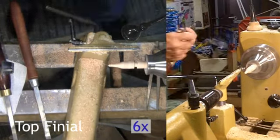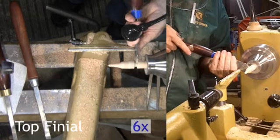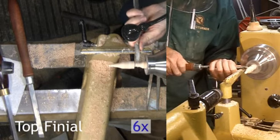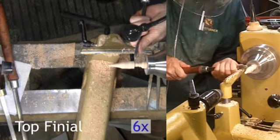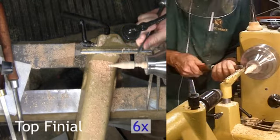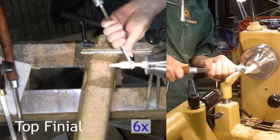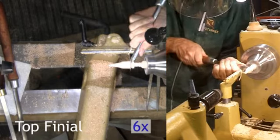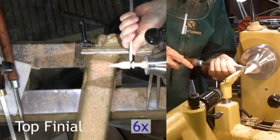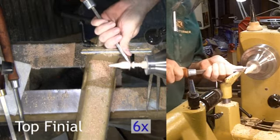My fingers get hot very quickly and for safety I don't want to wear a glove. But for the final cuts, I have no choice but to stabilize the wood with a couple of fingers from my left hand while holding the skew with the remaining fingers in my right hand. Fortunately, I don't need a lot of leverage and can hold the skew up near the cutting edge. I also used a parting tool — the clearances were just too small otherwise. I'm aiming for a 1 1/8 inch trunk on this little tree to fit in the 1 1/8 inch hole in the ornament body. The branches are just little V grooves cut with a skew, and these had to be very lightly cut. This little tree did not take much work to finish — I took the wood from the lathe, dipped the tree in the bottle of green dye, then wiped off the excess. When it was dry, I sprayed it with a little spray lacquer.